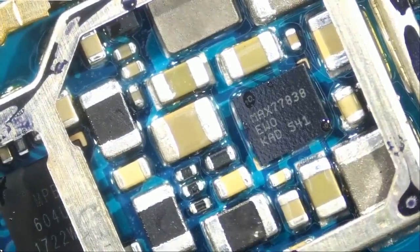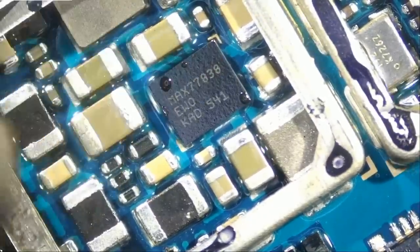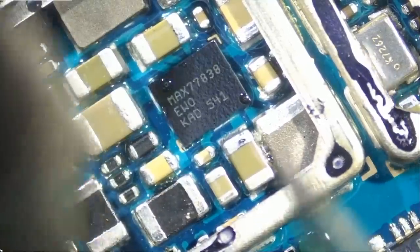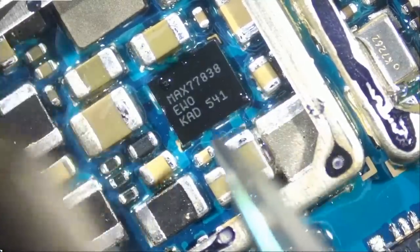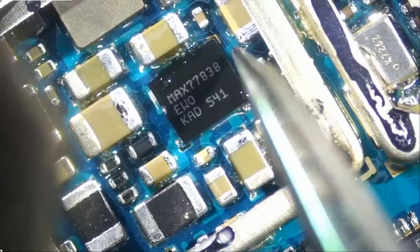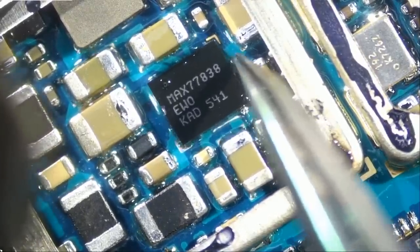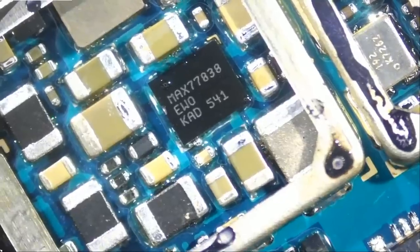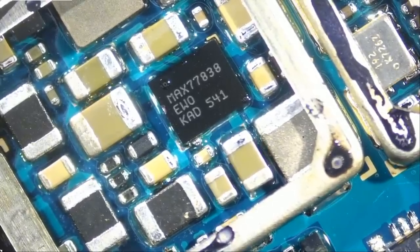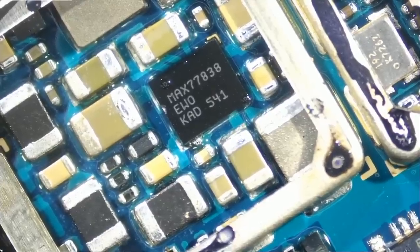The chip made a connection, and now we're gonna reflow it in place. It's gonna settle down in its place. Watch while we apply air, how that chip is gonna move. Perfect. Good, I just knocked it from the top. Hopefully not, because if I did touch it from the top, then the solder balls under it will squeeze and we will have to redo the job.